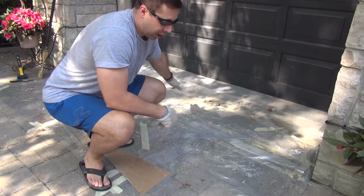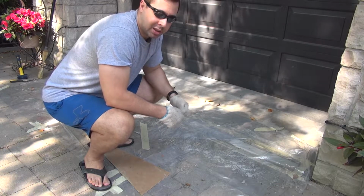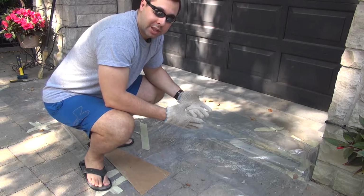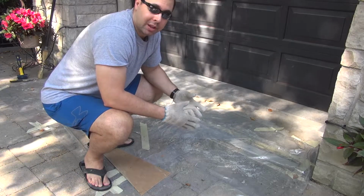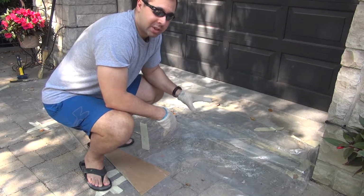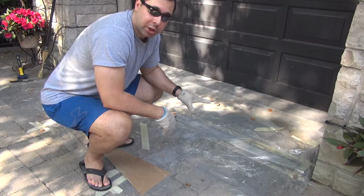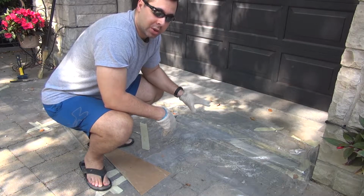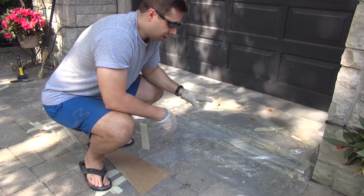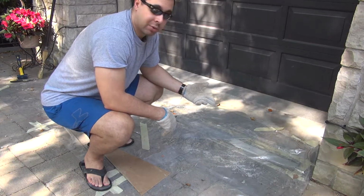Basically what is happening when concrete is wet, many people think that once you place it, the water evaporates and concrete dries up. And that's what happens when it becomes proper concrete. That's actually not what happens. Concrete, or cement in this case, actually binds water in crystal, so it's a reaction of sorts, and that's what forms concrete.